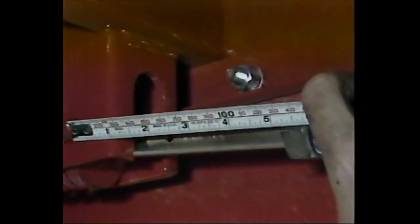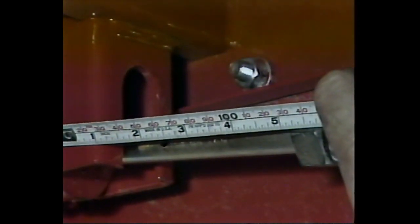When the spring tension has been removed, attach the yoke to the bracket provided on the ladder with a 1/2 inch by 3/4 inch clevis pin and secure with a hairpin. Next, place the yoked collar on the opposite end of the spring into slotted bracket, as shown here. With the ladder lowered, tighten the nuts on the rod to compress the spring. Turn the rod until a measurement of 5 1/4 inches is reached between the underside of the hex head and the front side of the pins on the yoked collar.